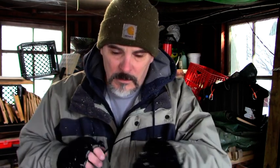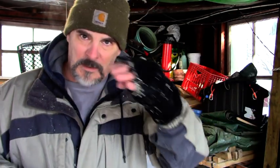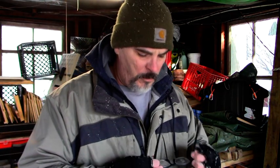Something you may have noticed in the previous clip too is I stand to the side when I'm feeding wood through the saw. If you're not careful, you could get kickback, and I had that happen one time, right in the groin area, and that hurt. So you learn real fast to have proper systematic ways you do things when you're working with the saw. And also the key is, you saw me, you're not going to get cut with the blade because the blade is not even near coming through the wood, but you want to press down all along that run. Keep your hand over the saw with the wood to make sure the wood's not going through like this and cutting where it shouldn't. That's an exaggeration, but you get the idea. You want to be careful of that.